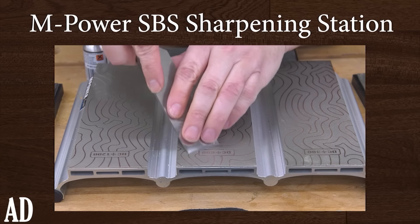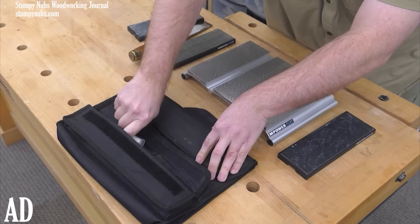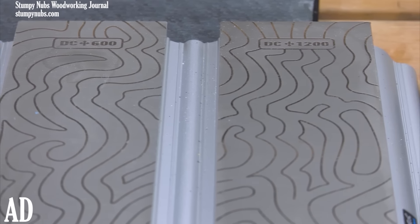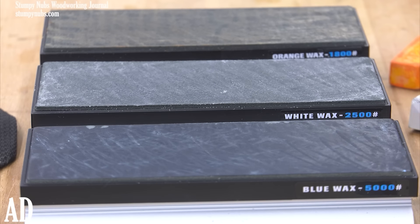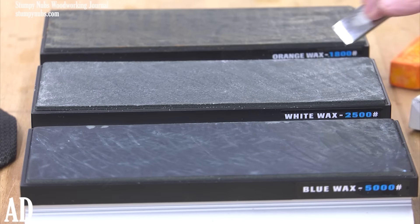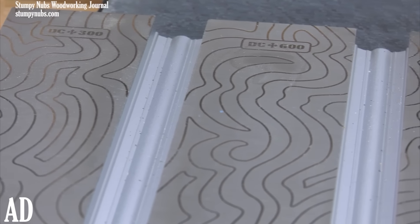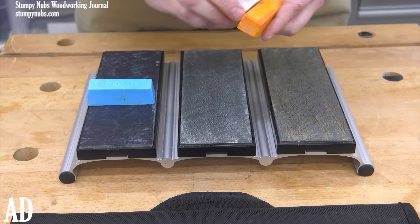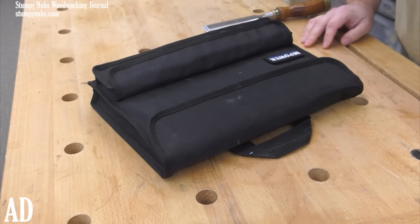Besides, you'll have as much fun as they will. And afterwards, you can reward yourself with this. The Empower SPS Sharpening Station is an idea that was four years in the making, designed to provide everything you need right in one place so you can sharpen and strop your tools quickly and get right back to work. It begins with three diamond plates: 300, 600, and 1200 grit. After sharpening, you pop on the magnetic stropping plates, which are color-coded to accept three levels of honing compound — 1800, 2500, and 5000. When your tool is razor sharp, everything including the compound sticks and the lapping fluid all goes back in the case. I like the simplicity of it — no more hunting around the shop for what you need. I think it'll be just the thing to take with me when I travel; I like to carve when I'm on the road. If you're looking for a new system, or a second one for working outside the shop, the Empower SPS system is something you should at least take a look at.